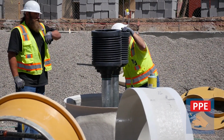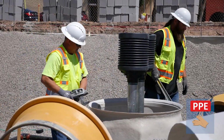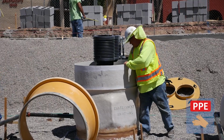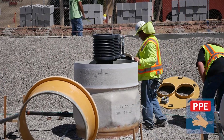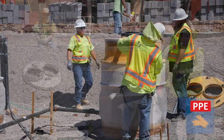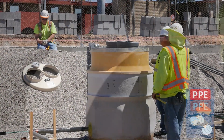Once this measurement is confirmed, it is a good idea to remove the spill buckets and store them until the multiport cover is installed at a later date. This will prevent the buckets from sagging during the installation process. Cap off the fill and vent risers until the spill buckets are reinstalled. Follow tank manufacturer's instructions for completing the installation of the sump base and riser sections.